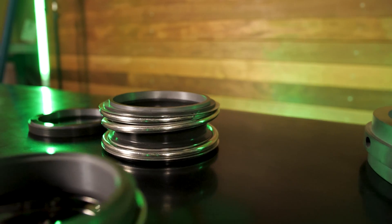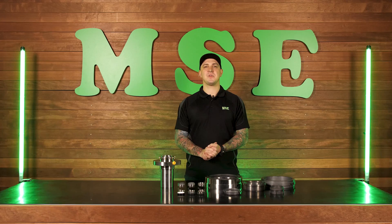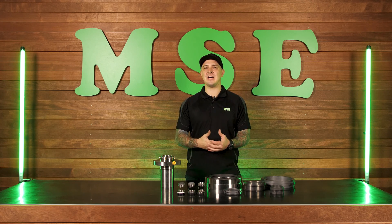There are two main types of silicon carbide: reaction bonded silicon carbide and sintered silicon carbide. All of our engineered cartridges use a high-grade sintered silicon carbide as it's a bit harder wearing. Silicon carbide has a blue-grey tinge and has a feel similar to glass or ceramic.